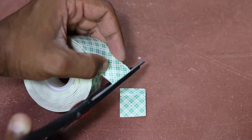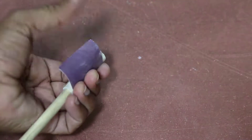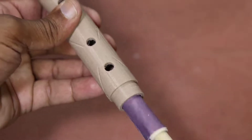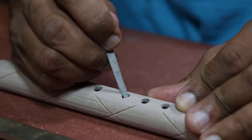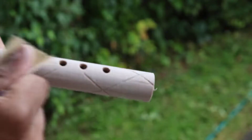To do that I cut a couple strips of foam tape, which I wrapped around a dowel, then took a piece of fine sandpaper and wrapped that around the foam tape. I used that to go ahead and clean up the inside of the flute and get rid of all the stringing. I used a small file to clean up the finger holes, then took the flute outside and sanded the exterior.